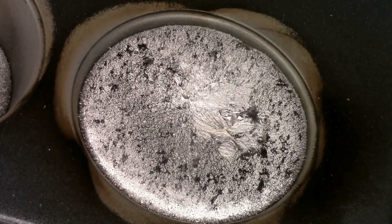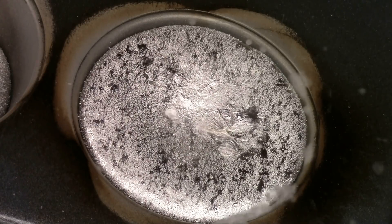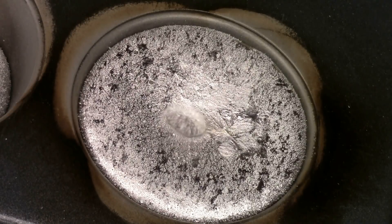While these things are still hot, I thought it would be a good opportunity to demonstrate the Leidenfrost effect. I've got a little bit of water and I'm going to drip it on top. Oh sweet — you can see the little droplet in the middle, that's exactly what I was hoping would happen. Aluminum shrinks as it cools down, so it kind of collapses in the middle a little bit, giving you a depression, and that's what the water is sitting on top of. Really cool.